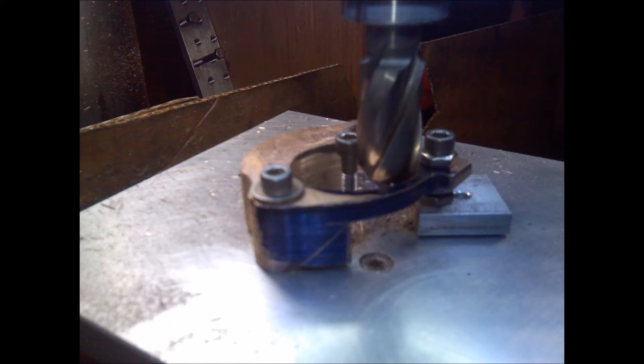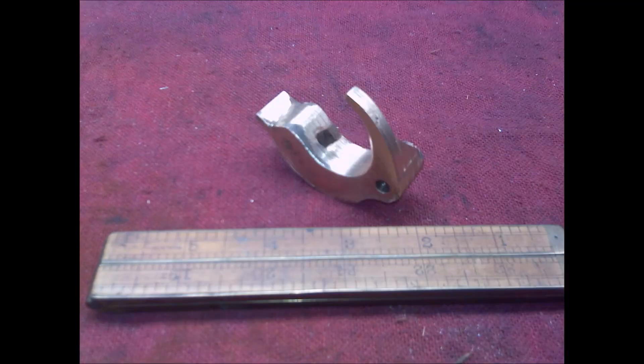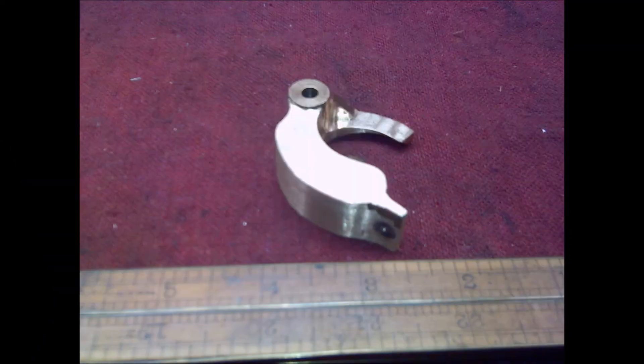Here I'm using a 45-degree end mill to machine that ramp. Here's the finished piece — the little rectangular piece in the middle is a piece of rawhide that's used for lubrication and dampening the sound of the thing clacking when it's in operation. Here's another view — again, very organic, a lot of handwork on this.